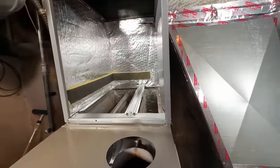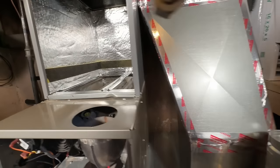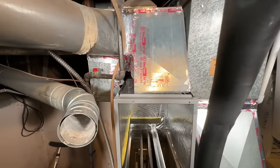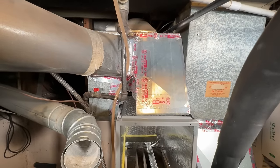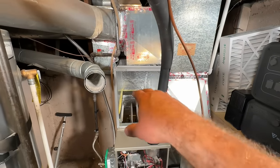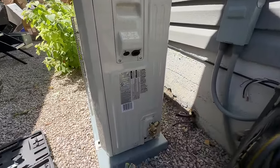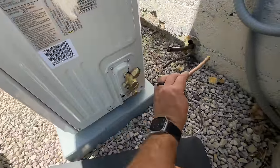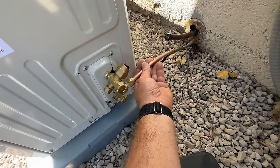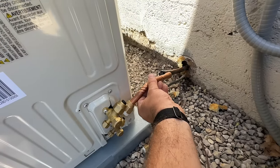The new box is in and everything fits really nicely. We're going to run a layer of tape on the bottom side and attach it back on top how it was. Here's our new AC IQ condensing unit with our two fittings that are going to work out nicely. I confirmed that a filter dryer is not needed and not recommended — I confirmed that with HVAC Direct. That's where our two fittings are going to go, and then we'll re-insulate that line.